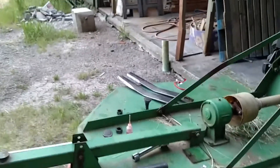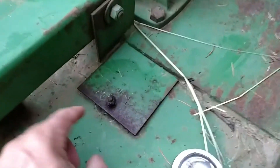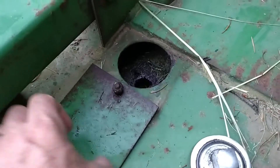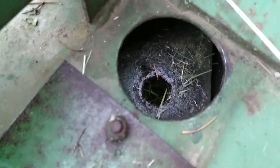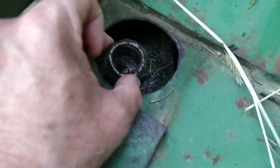If you look on top here you'll see an inspection plate. It's a half-inch nut — all you do is loosen it and rotate it out of the way. You don't need to take it all off. Right there will be the access to the nut that holds the blade on — it'll just look like this.